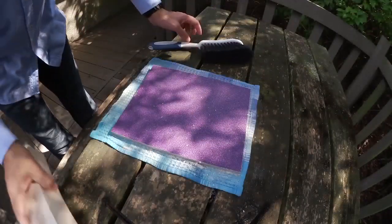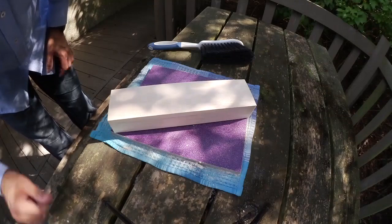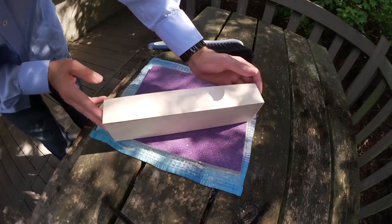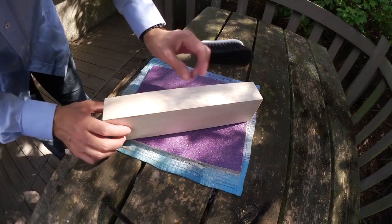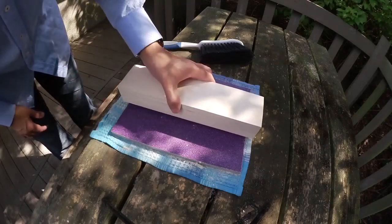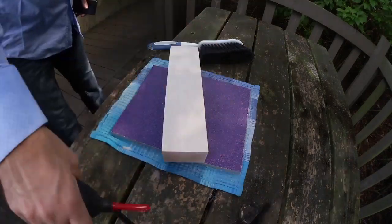I'm going to suppose that this was the same thickness, give or take its nominal variance as a piece of balsa wood, across its entire span. So let me go look on the triangle calculator site and figure out what the arc of a 3.5 meter radius thing going this way would be at the center. How much rise should I be shooting for? And that way I kind of know when I've basically got it to succumb to this shape. It should also be slightly thicker in the middle than it is on the ends, which actually I could already see that it is.